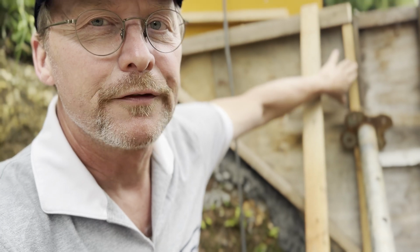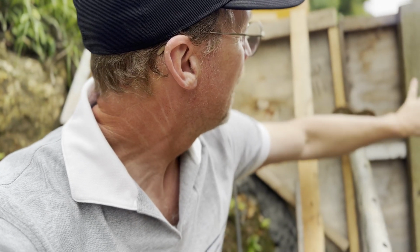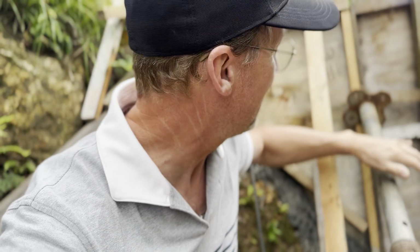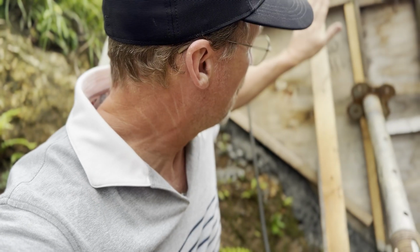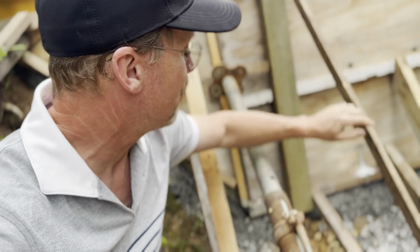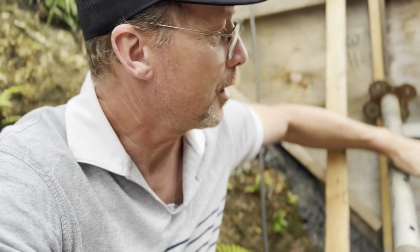This is the failure point. And you've got a form here and a form here. This screw support is our recovery. It wasn't here at the beginning. When we poured, we only had this support, a lower one, and the same over here, this support and a lower one. There was nothing supporting the actual butt joint where these two forms met. So we got the support in here and we patched it. It took a few seconds only. It wasn't a big problem.